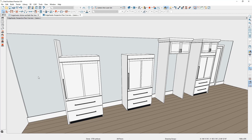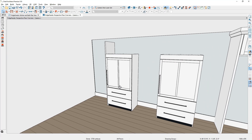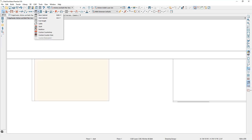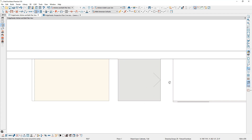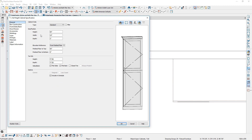These partitions don't have components to put face items on them. So if you want face items, you're going to want to use a full height cabinet, set it to one and a half inches thick, and apply the face item. Let's do that off to the side. From the plan view, I'll place the full height cabinet, rotate it, bump it up against the refrigerator cabinet, and slide it to one and a half inches. Your cabinets may snap in three-inch increments with a minimum size of nine inches — remember you can always double click to open the cabinet and set it to any thickness you want.